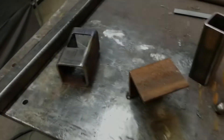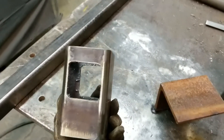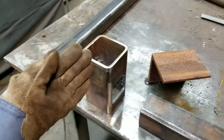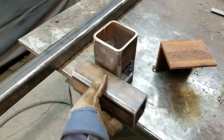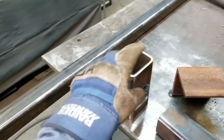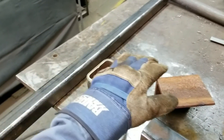Over here I've got that 3.5-inch HSS — I just oxy-fuel cut that with the torch. When it's in position this piece will be vertical like it is right now. This inner piece goes inside it and will have a hole with a pin going right through it. Then welded on top is going to be my 10.5-inch square plate with the bolt hole pattern.